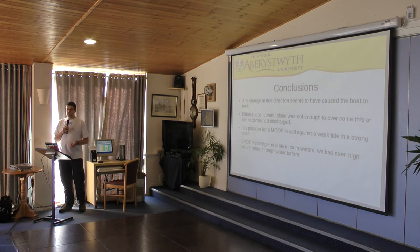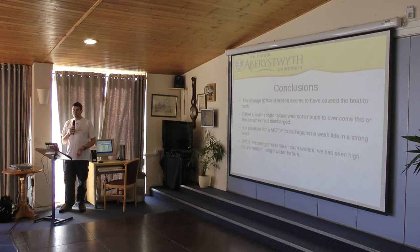And we'd also had issues before with Spot Messenger, which we used to track its position. So we put this on our transatlantic boat, and we had a report every 6 hours, and we had about a 50% message failure rate. With this, I think we had a 95% success rate. So this was a lot calmer water, and perhaps slightly better mounting of the spot. That actually suggested in calm water, the spot's fine, but maybe when you take it out to the rougher seas of the Atlantic, the pitching and rolling is too much to maintain a satellite signal. And spots are a one-way simplex transmission system. So if you can't maintain that two-way comms, you have no way of acknowledging your message got through. And maybe it's not the most reliable system to be using.